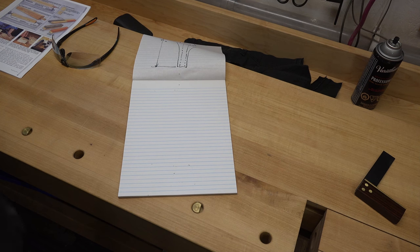Let's head over to the bench and I'll give you a quick drawing to explain what we're looking to achieve. If you're able to get three-inch by three-inch stock to turn the pieces of this music stand, this lamination won't be an issue — you can just bore a three-quarter-inch diameter hole from end to end with an auger bit and you're good to go.